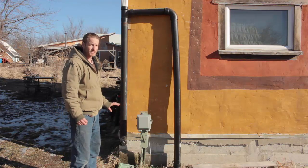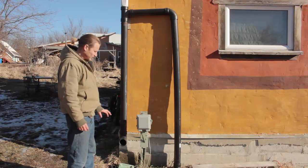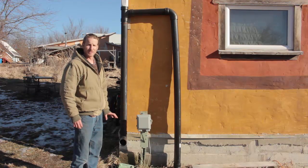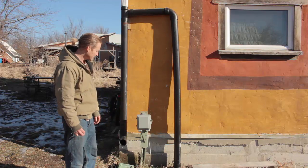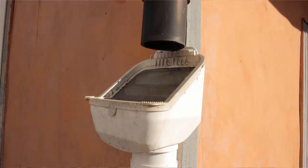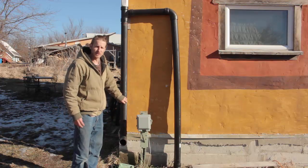There are different ways you can set this up. With this tube, every time it rains, I have to come and unscrew this cap and let all the water out. You can also get a first flush kit, which will do this part automatically. The problem with that is we have cold weather in our region, so if you don't take it off by a certain time of year, you might end up ruining it. This manual system is easier — I just take the cap off when temperatures start getting to freezing and stop collecting rainwater in the cistern. You can also put a screen cap on it, which is another way to divert larger debris like leaves so they won't even get caught in your flush tube.